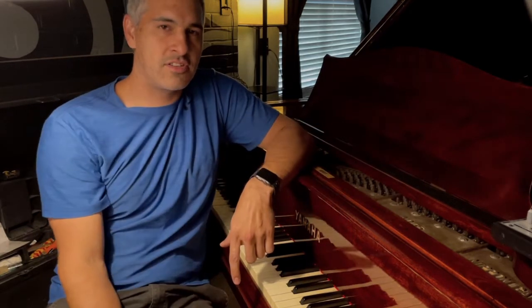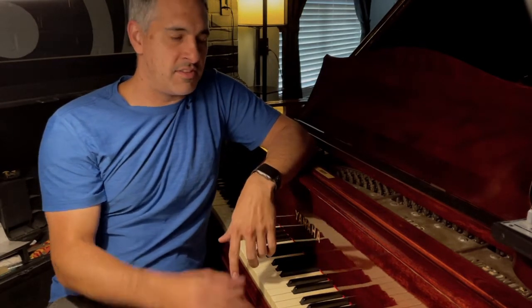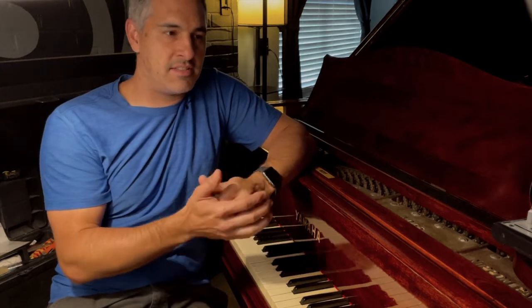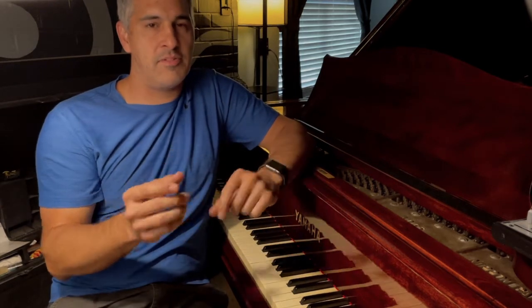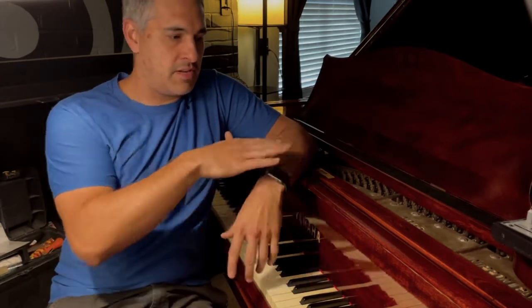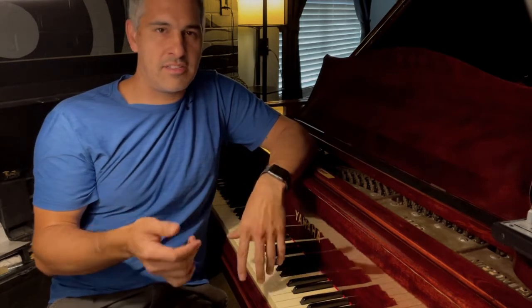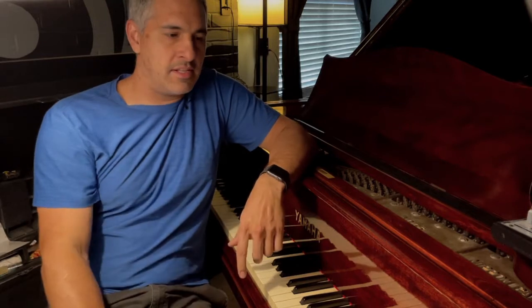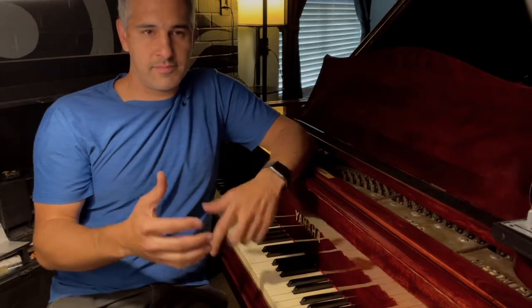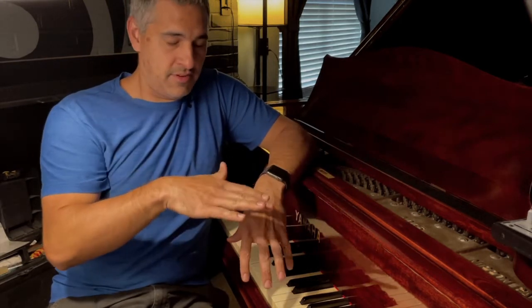So, getting right into it, we're going to restore this beautiful Yamaha 6'4" grand piano. I'm going to take you through the whole process of when I did this wood finish. It's a Campbell two-part system for the most part. The sealer that goes over the bare wood is a two-part. It has the main component and then the hardener, as well as the top coat clear that's meant for the finish and the shininess that you see. It's a base component, and same thing, you're mixing it about 5 to 1. It's got a hardener that goes in it, so it creates that chemical reaction, and you get a nice, hard, almost like plastic coating finish, just like the clear coat you would put on your car.